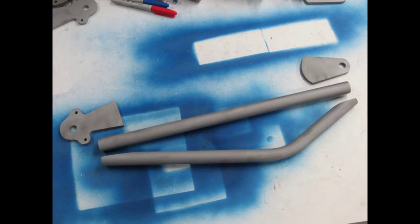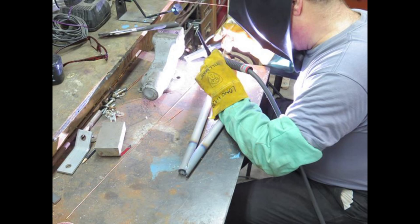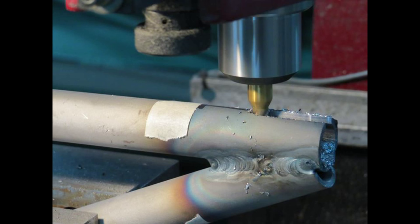The main parts for the girder front end — this is much heavier than an original girder front end on a Norton. The look when you see the bike doesn't look much different, but it really is substantially stronger. All those tubes went through the milling machine for fish-mouthing and angle cuts, carefully done on the mill for better welds. I mocked up the girder front end in cardboard to get the positions exactly right — this process works really well, cardboard is cheap. I put a fillet between the upper and lower horizontal arms where the gas tank goes, and added lightning holes to make it more mechanical-looking — period appropriate. I milled the final slot after the tubes were welded to ensure perfect 90-degree cuts and proper alignment.